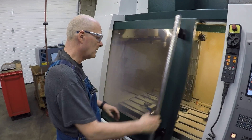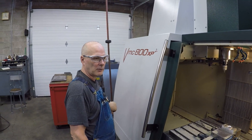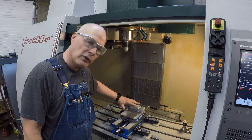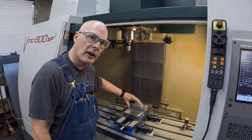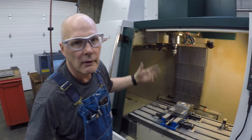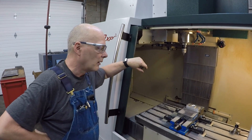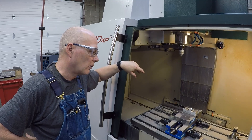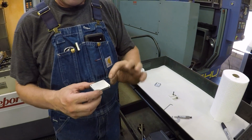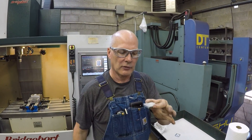There we go. You can get a lollipop cutter or one of the fancy little cutters and put undercuts in here, but you have to be careful when you clamp for your first operation that the clamps overlap on a solid area. You can go around and cut chamfers on everything and have a completely finished part — completely deburred, the whole nine yards. The only thing you're not going to deburr are the holes in the back, and you can do those by hand or set up another setup.